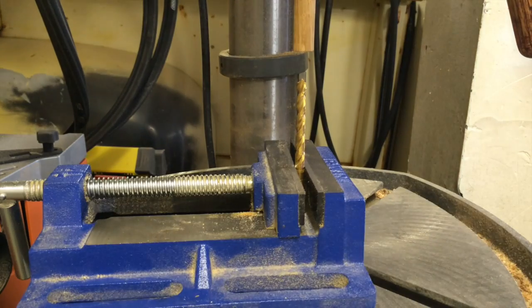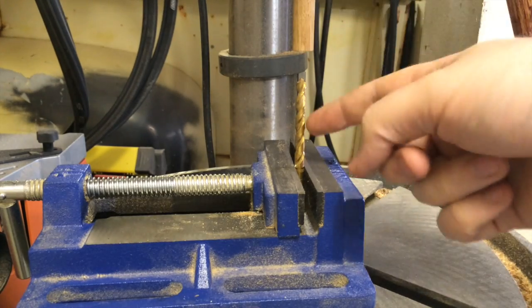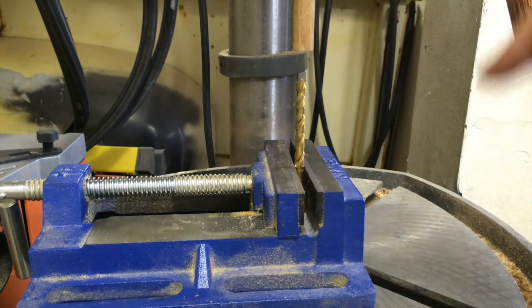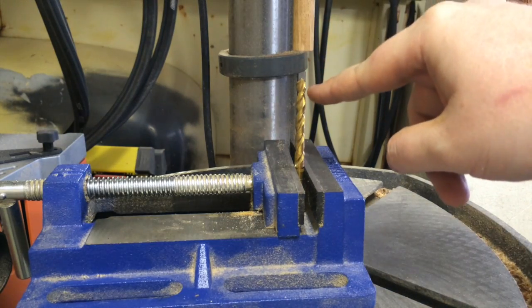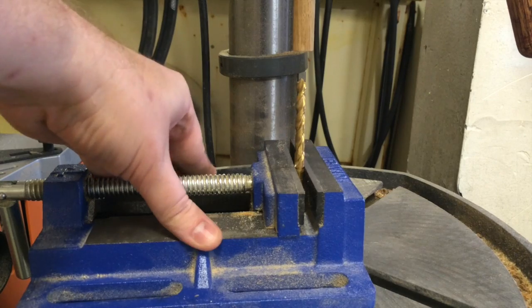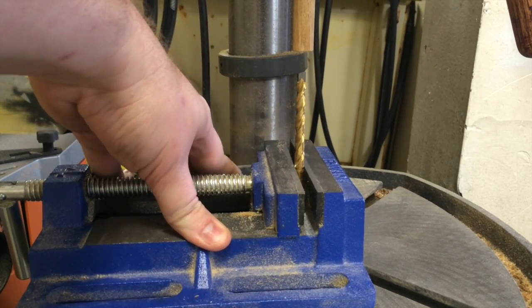You don't want this super tight on wood because you don't want to mess up the wood. And that's it — we're now perfectly aligned. Everything is going to want to self-center. The only time you need to be careful is when you first drop this down; you'll want to go slow until we get a good bite. Then we'll go about halfway, take it out, reverse the material, put it back on, and we'll be done.